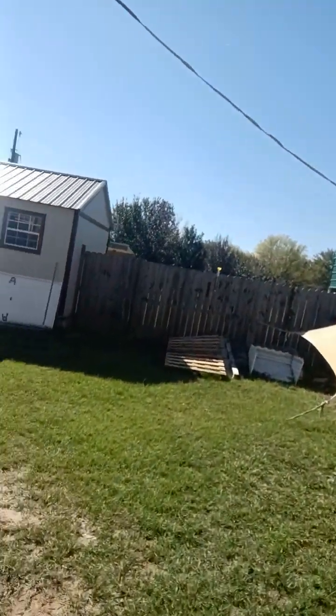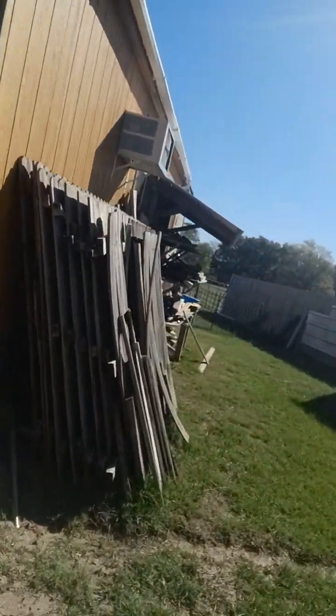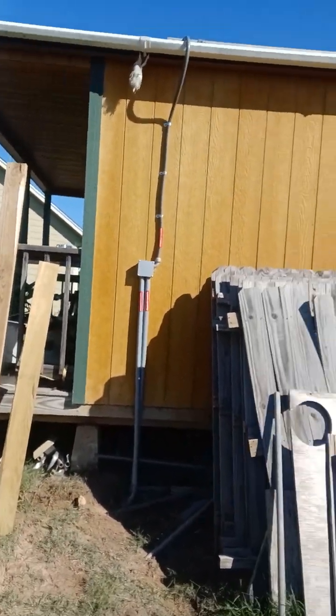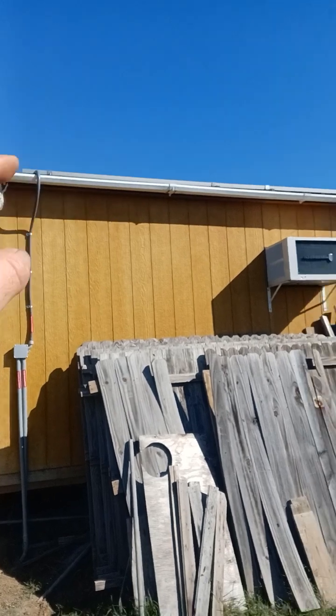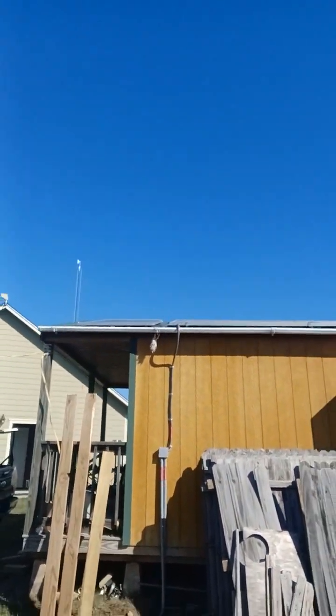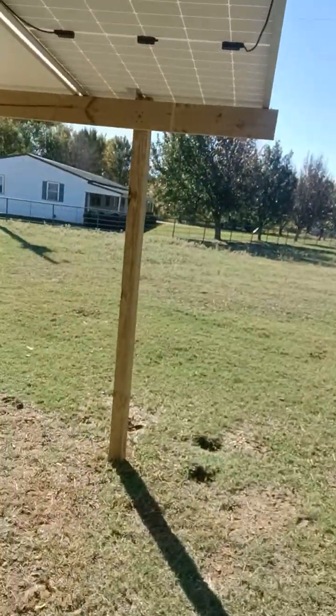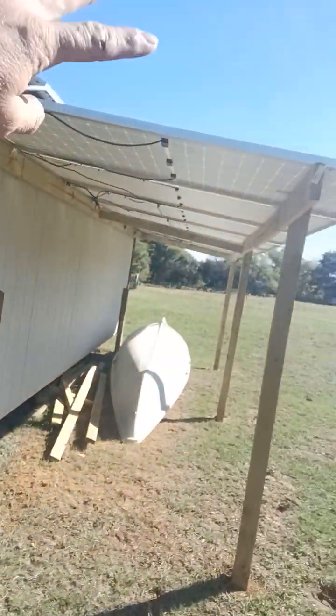Over here, under the ground, roughly about 50 feet away, we have a loop coming in and down and shooting over for the PV array. We have 11 solar panels sitting up on top of the roof here. That would be for MPPT solar controller one — and there's four of them. So we have 11 on chain one and 11 on chain two.